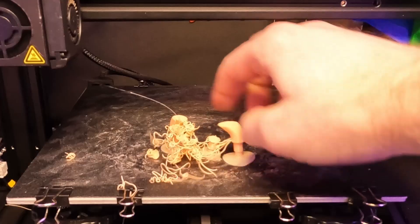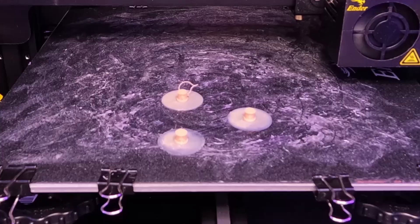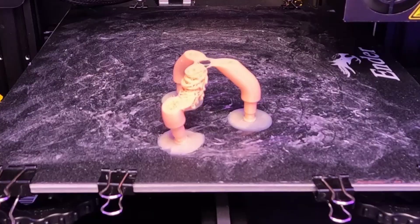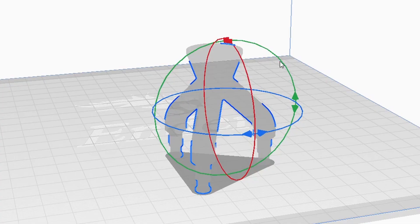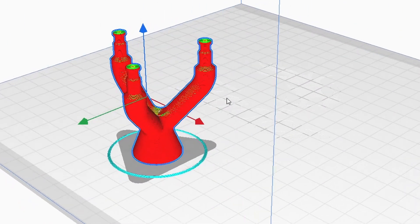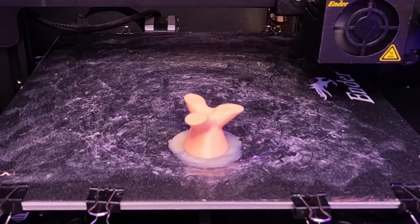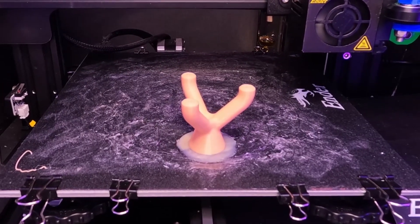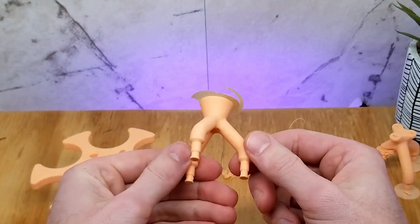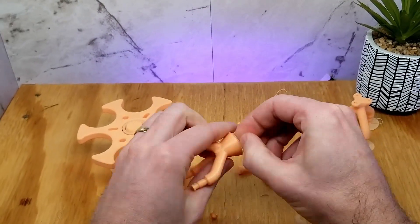This is getting slightly annoying — one more time. I think it's probably a combination of things. It's kind of neat how the 3D printer actually tried to reconnect the legs, but it's still unusable like this. I can't tell you exactly what's going on, but it's causing me to rethink the printing orientation of this part. Originally it was a different shape for the knob on top, and it was changed to a flat on top which allows it to be printed more or less upside down — hopefully eliminating the overhung geometry from the narrow bed plate adhesion surface. And just like that I have the first spinner, with just a little bit of brim still left on it which I found out later was unnecessary, but I wasn't taking any chances. I'd prefer a little extra simple cleanup than another failed print.